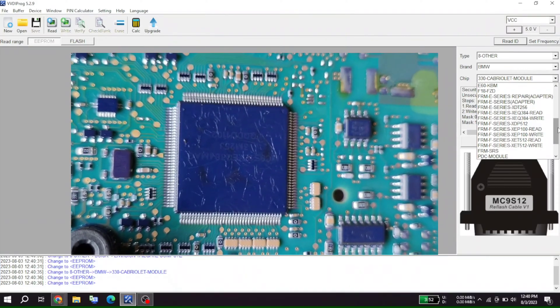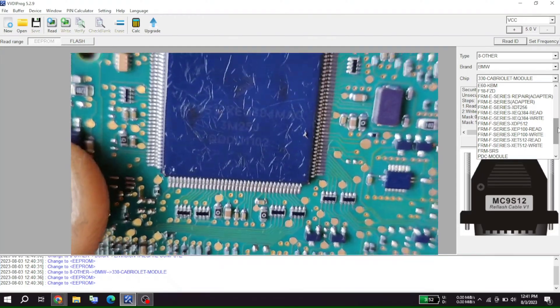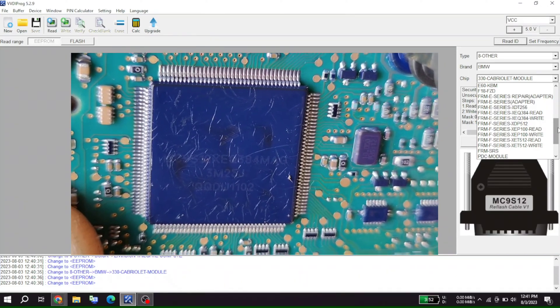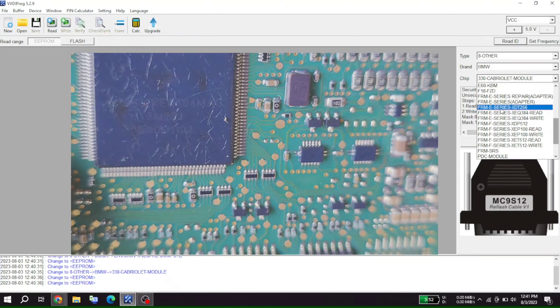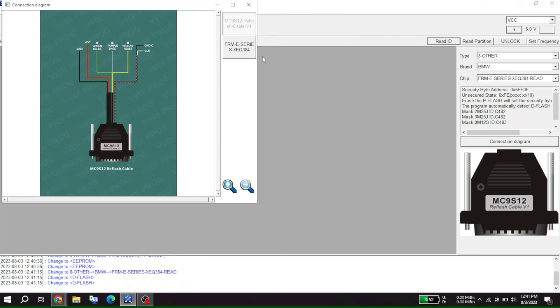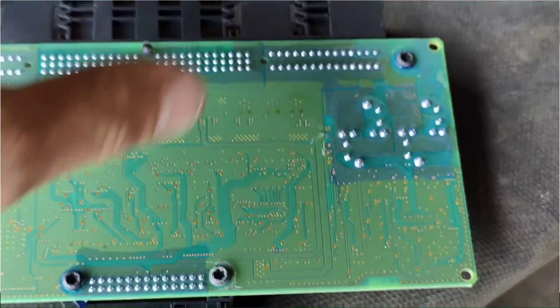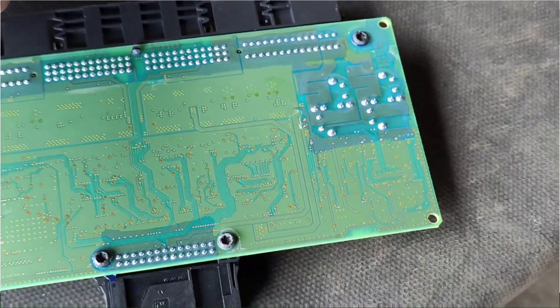Right there it's a 3M25J — let's see the rest of it. 84M, so it's a 384. We can see 384 right here, so we're going to click this. Then we'll go to connections — this is what we've got to connect up. I'm going to solder these up on the back to our points and then we'll try to read this and fix it.